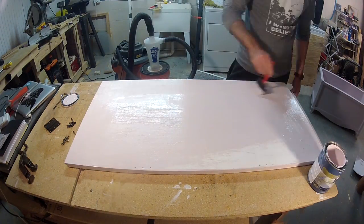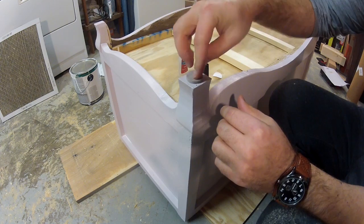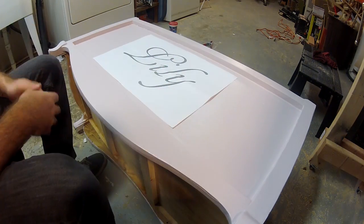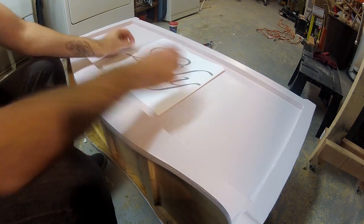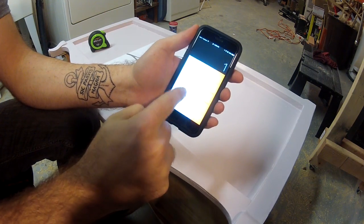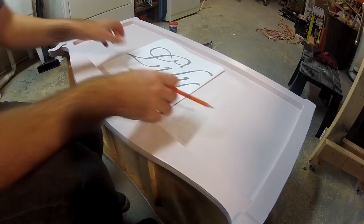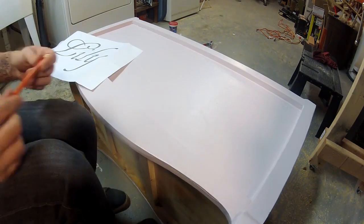It's also a good idea to disconnect the lid so you don't accidentally paint over the hinges. Now I'm going to add some furniture feet — I add a little bit of super glue because in my experience they always fall off chairs, so just add a little glue and you're fine. Now I'm going to start painting the name on the front of the chest. I have the name of this font in the description — you can print it out if you'd like. What I'm going to do is fold over the sides so that the edge of the lettering is on the edge of the paper, measure the width of that, take the width of the chest, subtract them, and divide by two. That will tell me how much space will be on both sides so it's centered perfectly. So I'll unfold it, mark where it goes, and then I'm good to go.